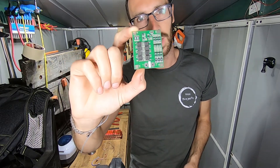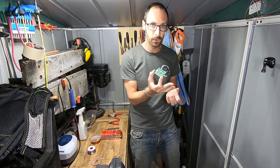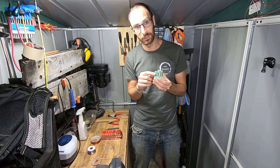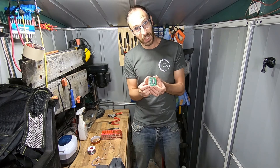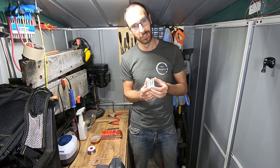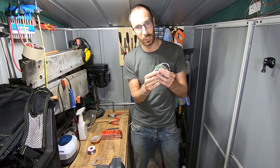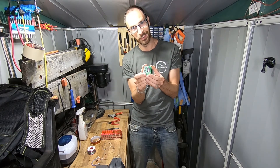The MOSFETs turn the battery off when the voltage gets a little bit too low so you don't damage the cells. Why do we actually need a BMS when we didn't put them in the original packs? We thought we could get away without it because we matched all the cells, so they should charge and discharge about the same — we wouldn't need the balance circuit. And the solar charge controller would control the output and make sure we didn't over-discharge them. But we've found a few cells which have died because we're using secondhand cells. So just for extra peace of mind and zero maintenance, we're going to put them in anyway.